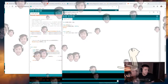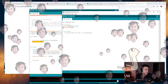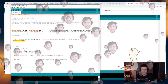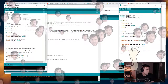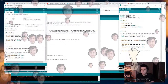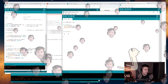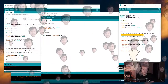What is it? Serial? Okay, maybe we did need a little bit of this. I don't know why I'm doing everything at 9600 baud. Maybe just in celebration of this beautiful music, I just want to do everything at a low baud rate. And then we will do a... What even should this be? Now that's for the circuit we're not going to use, probably. Where's the other one? No, this one. Yeah, it's just an energy value, right? It's a 10-bit number, so just int. And then let's just spew that out to serial. Like this.